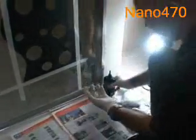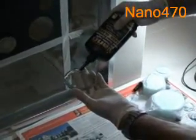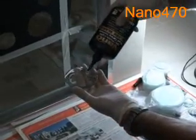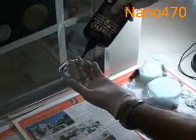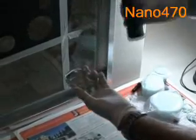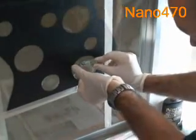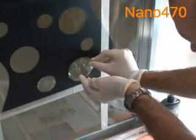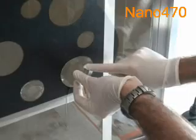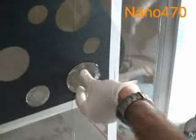We're going to place our bevel on. Now, what we're going to do is coat the bottom half of the bevel. The bottom half, because that's where we start. We start at the bottom of the bevel and we let the adhesive flow up the bevel and over the top. Sometimes it's good just to put a couple of drops at the top there, because that's very important to get the adhesive flowing up the top of the bevel. So we start at the bottom and we gently lower the bevel down onto the glass using that bottom edge as a pivoting point, and we can see the adhesive flowing up, and I want to see it flowing over the top of the bevel like such.